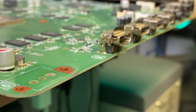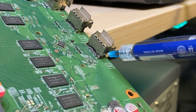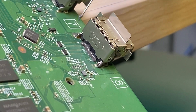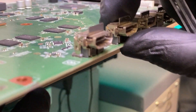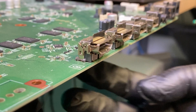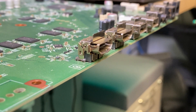I've got some 138 solder. What I'm going to do is pipe it here along the legs, along all of the pins. This is going to mix with the factory solder when I heat it up — these legs in the back as well. It's going to mix with the factory solder, which is typically around 183 or 217. I've got my motherboard hanging off the table here, enough space so I'm not burning the table. We're going to max out the hot air rework station — 500 degrees Celsius with max airflow.